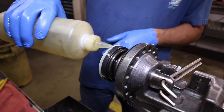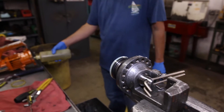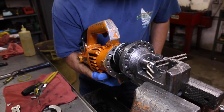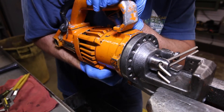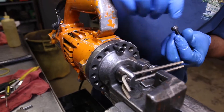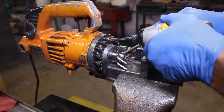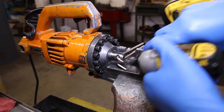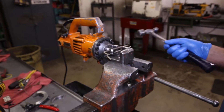Step 12: installing the cylinder. Place a bit of oil on the new seal and some in the cylinder. When installing the cylinder, hold it with a slight downward tilt and with a little pressure it should go right in. Now begin installing all of the cylinder bolts, then finish with a driver and fully tighten. Note there are 14 total bolts — 12 on the front and 2 in the back. Now remove the allen keys from the piston.